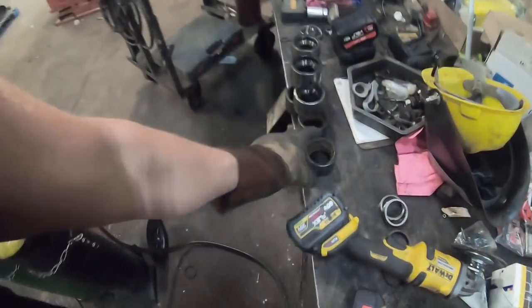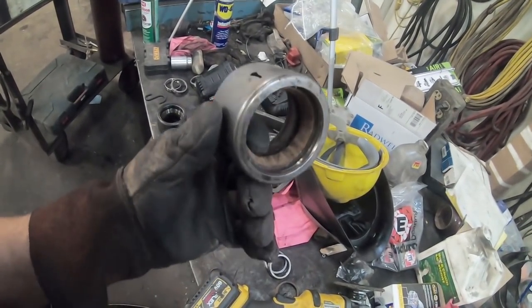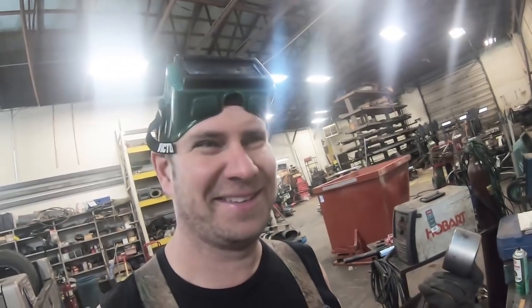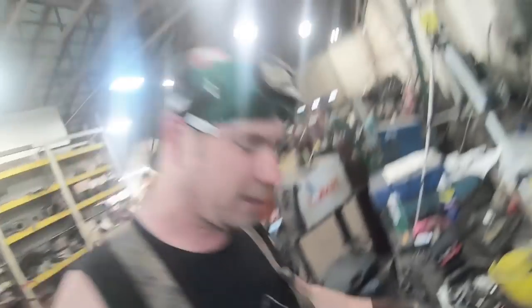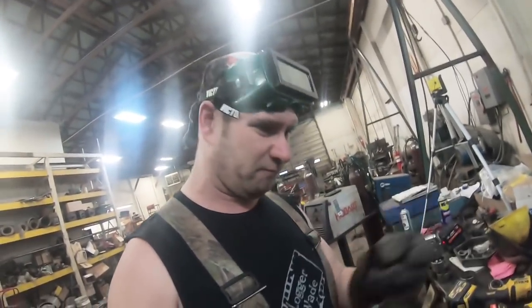What we're doing here: you can see where the old bearings got full of dirt and contaminants. I might bunk the races out and swap out races. You can see the contaminants in there. They try to make a sealed bearing — they seal it to the world — but in this application you're taking chunks and beating on them all the time, there's dust and everything gets in there, pushes right past the dust seal up into the bearing. The grease comes out, dirt goes in, and you're never purging it.